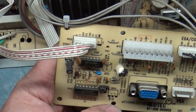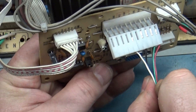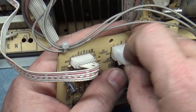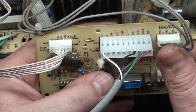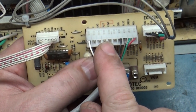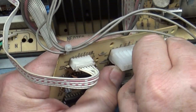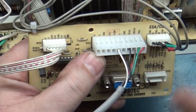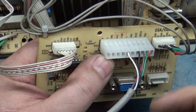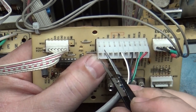I had the connection set up like you normally would and could not get this to sync for my life. After taking a closer look, I realized composite sync is actually pin number 6 and not pin number 10. So when I moved it over — ta-da — I got my sync. It's important to know that if you have one of these and you're trying to use it, you have to have the sync signal on pin 6 and not pin 10.